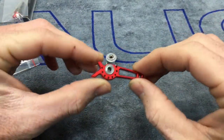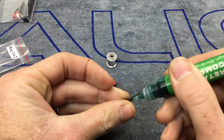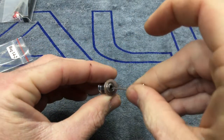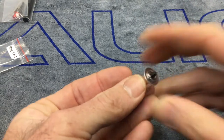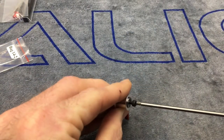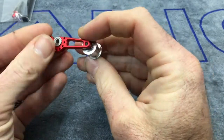For the second tensioner, it has a goldfish-like shape — you want the long side down, the hole side facing down. It calls for retaining compound. Each side of the pulley is the same with a little brass insert — use a T-pin to center the brass insert if needed. Slide the bolt through with a bit more retaining compound on the threads, going bottom up. The bottom has a little recess like a built-in washer. Screw down with a two and a half millimeter driver and tighten — confirm it spins freely.